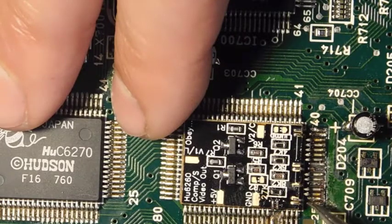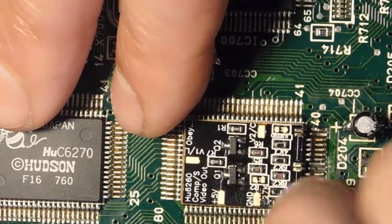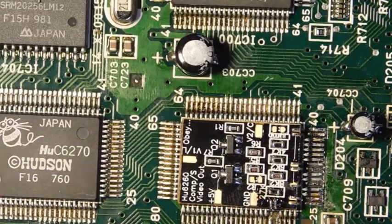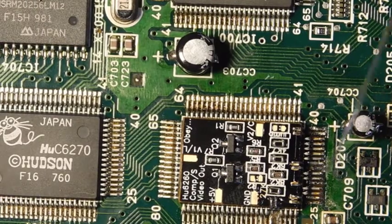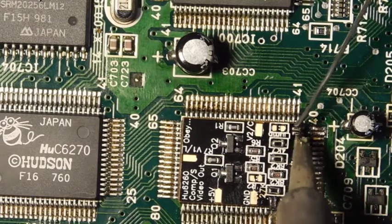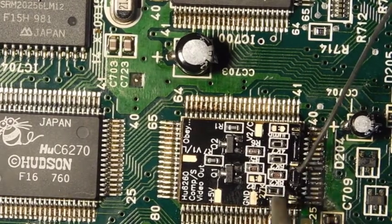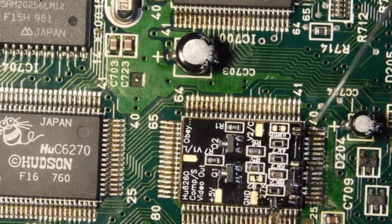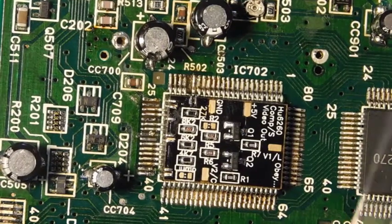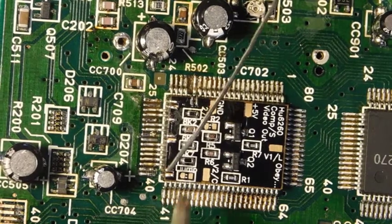Now they're all in position where they're supposed to be. These two were a little too close for comfort — I've separated them so their spacing is a little better. From here we're going to take some flux and solder and attach these pins. You want to be careful; you don't need a lot of solder here. I still have three more to do, and to do that I have to rotate the board because I'm left-handed. I come at these from the left and I don't want to bridge the other pins on the other side, so I want to come at them from opposite sides. Those of you who are right-handed, just do the opposite.